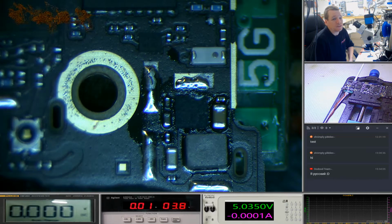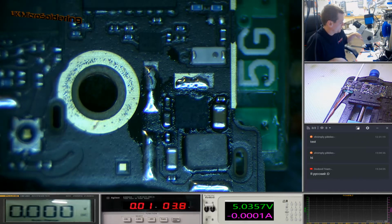Obviously that's 4 minutes. You leave this on here for 24 hours overnight and not dry it out, or even worse, 3 or 4 days, you're adding the electrolysis into corrosion and stuff. You're in murky waters whether anyone's going to be able to repair it or not. So, even an hour like this without disconnecting the battery is quite a large amount of damage.